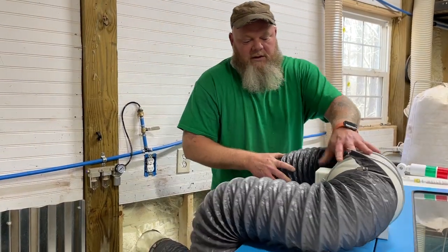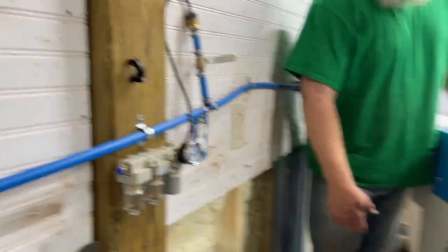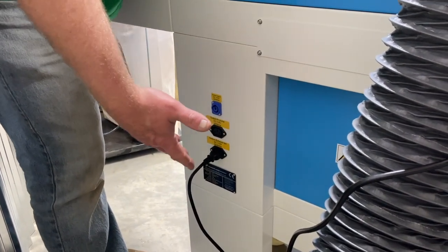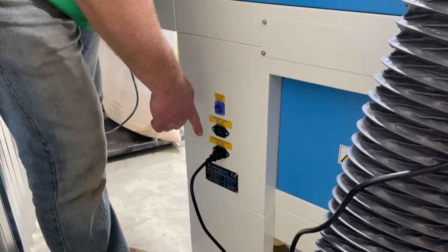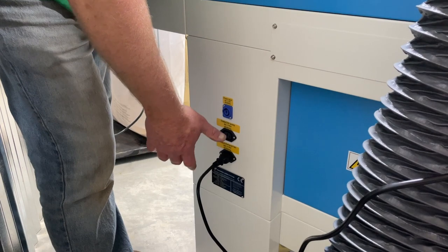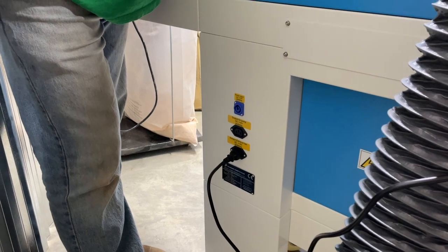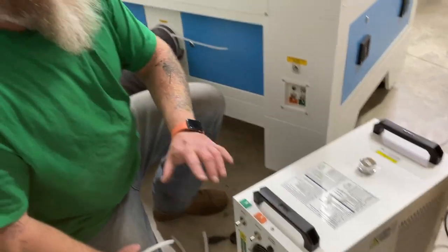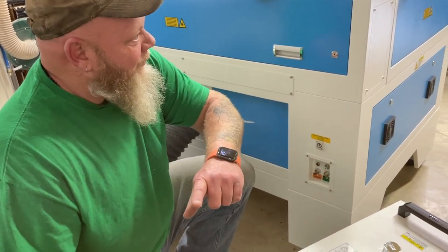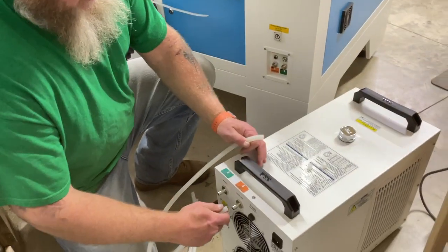I'm going to leave this up here for a few and hopefully my camera woman will walk around so we can see where the plug is. The plug for the fan is going to be the bottom of the three — they're all labeled. Your power, your air and your fan are all on the left side, where your chiller is going to be on the right side of the machine if you're facing the back, or vice versa. Thunder does this great — orange to orange, green to green, not like other ones where you've got to figure inlet to outlet, outlet to inlet.